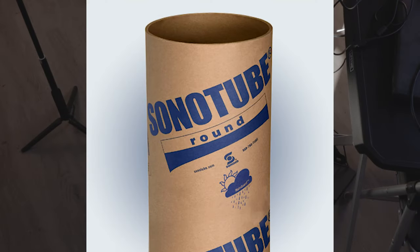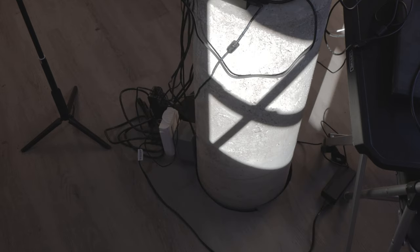That saves you a lot of time. I use sonotubes at 12 inches in diameter to create the pier itself. The sonotubes come in four-foot length sections, so I put two of them together and ran some wire through them to make a seven-foot-long tube.